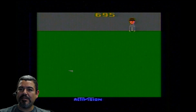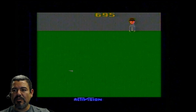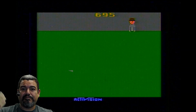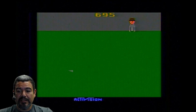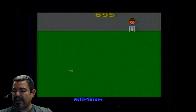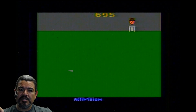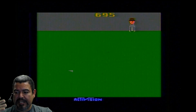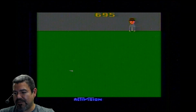Oh, one other quick thing that I forgot to mention about this card is that I'm capturing it directly on OBS, and OBS basically defaults to capturing on channel 3 when you're capturing on a card like this, which happens to be perfect because a lot of devices that output RF are going to be on channel 2, 3 or 4, and 3 is right in the middle. So it works out. There's no way that I've found to change channels in OBS. If I do want to change the channel that I capture from, I can use VLC, and VLC actually works perfectly with it as well. So that's another option if I need to capture on a totally different channel other than 3. Some other times I might be using that to capture video.